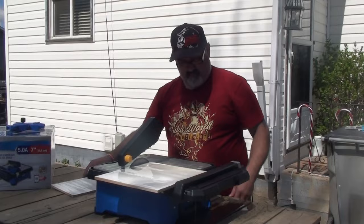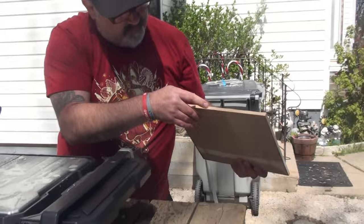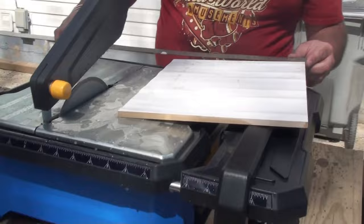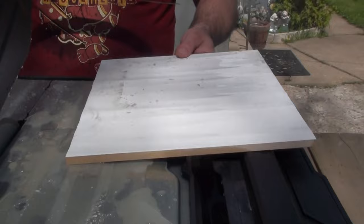Check out how good it did. Here's my cut. I was cutting that at 10 and three-quarters, so let's see how well that did. Okay — 10 and three-quarters on that end. Pretty close, just one little tiny thing. That's nothing to worry about because that's going to be covered by caulking in the corner. It seems fairly smooth on there.